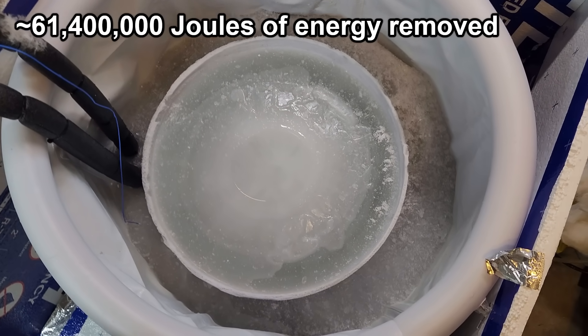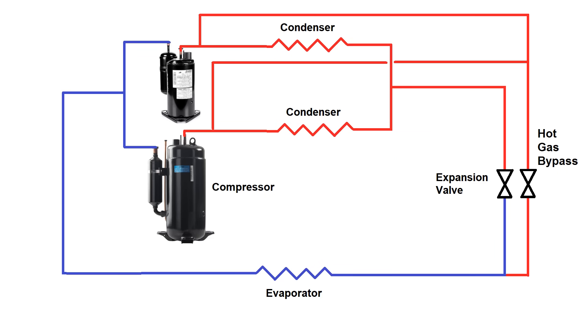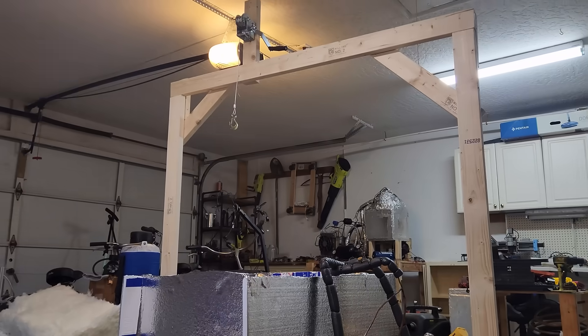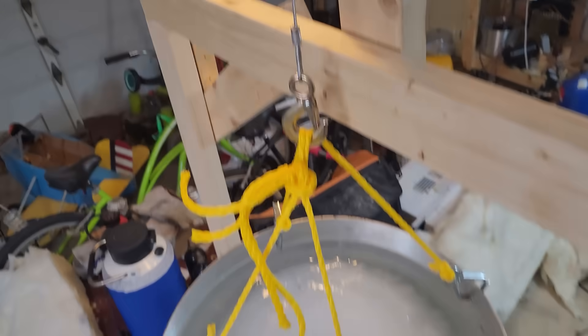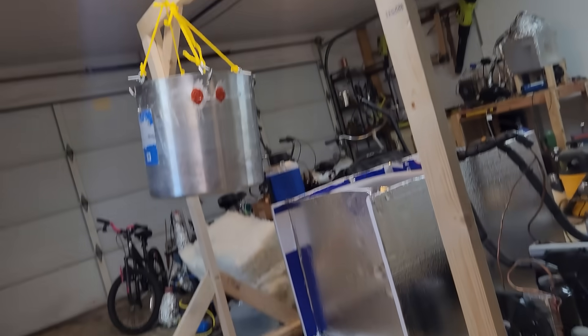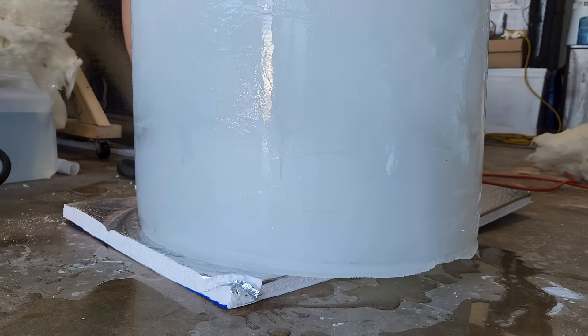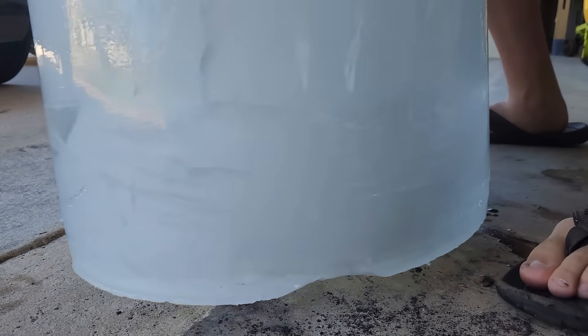In total there was about 310 pounds (140 kg) of ice. The calcium chloride ice hardened enough that I couldn't pull the ice pot free, even with an ice pick. Since I hadn't installed a reversing valve or hot gas bypass, I ran the system with the condenser fans off and the throttle valve wide open, which effectively did the same thing as a hot gas bypass. After about an hour the coils had warmed the cooling bath ice enough to break the pot loose. I then used a crane with a winch to slowly raise the pot out of the cooling bath, moved it clear, lowered it to the ground, flipped it over, and within a few minutes the surface warmed enough to slide it off the ice — frozen all the way through.